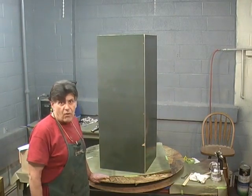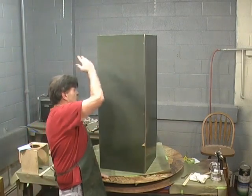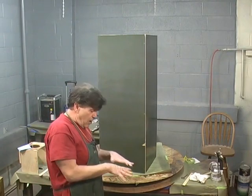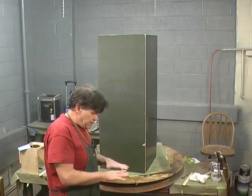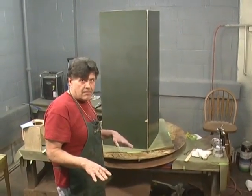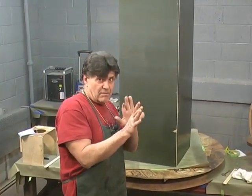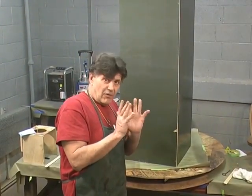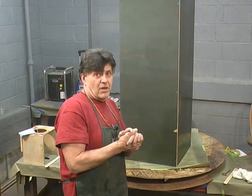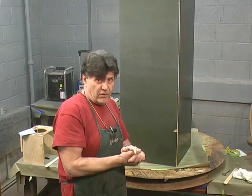Again, water base will go on kind of foggy looking, white, milky looking, and it will look that way. But in a horizontal environment, all of that material is flowing out level. It's going to self-level, sort of. In a vertical environment, it's got to kind of run, but not. So that's the practice. Practice horizontal first, but then really work hard on your verticals.